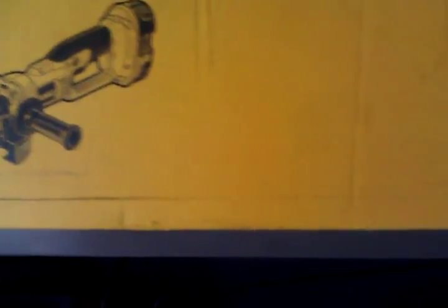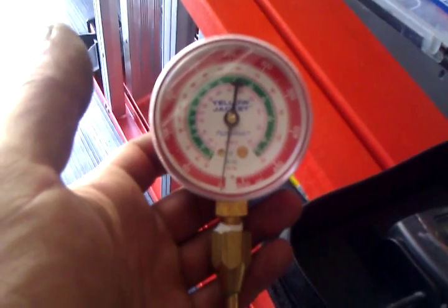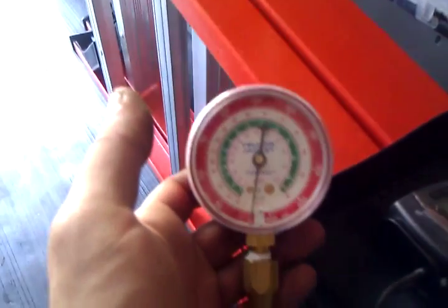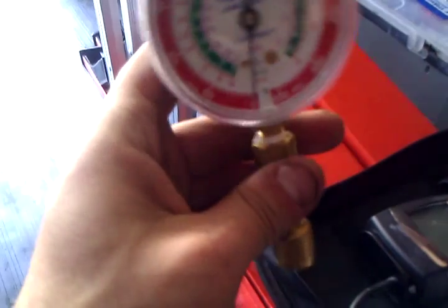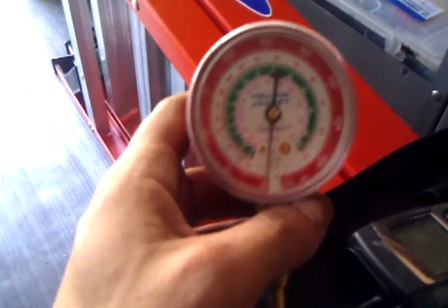Got my little snake for small sinks and stuff like that. My cordless grinder. Got my tubing over here — soft copper tubing. This box is the half-inch, and behind it is my quarter-inch and my three-eighths. This high-side gauge here is really good to have — I mainly use it for ice machines. Most ice machines I work on, the charge in the system is usually anywhere from one pound to one and a half pounds, so if you use your gauge manifold, half the charge ends up in your hoses. With this, it just screws right on, and when you unscrew it you practically lose almost no refrigerant — much better than using your gauges.